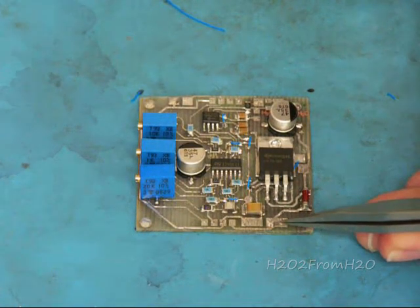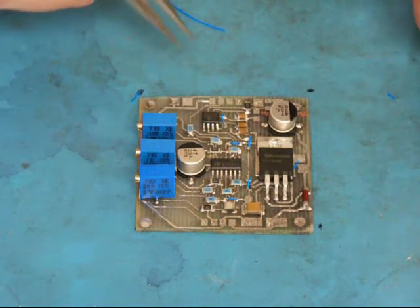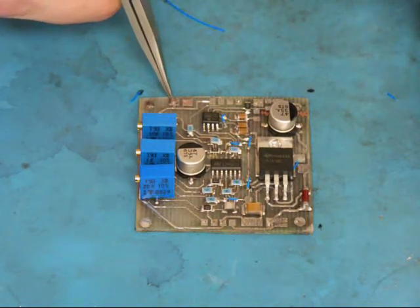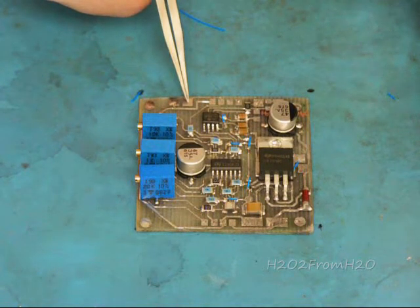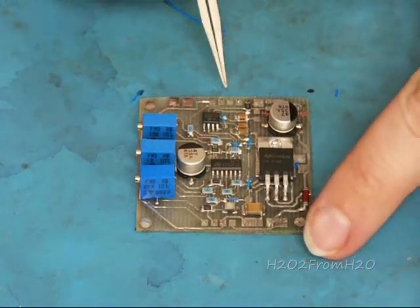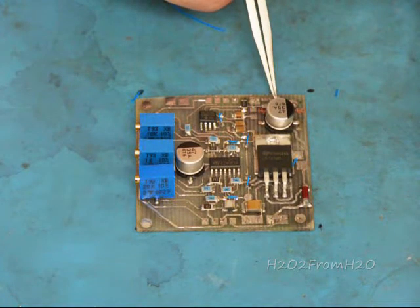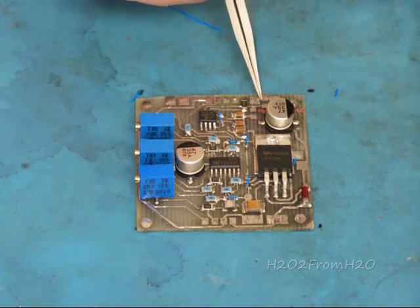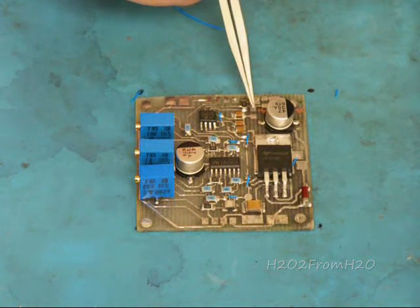This is where our 12 volts comes in, and this is our ground. Up here we have our 12V ground, this is our 12V positive, and this is our current sense input. We have gate 1 for the output of the MOSFET, and gate 2 for a secondary set of MOSFETs if you choose to do that. Currently R20 and C13 are not stuffed.